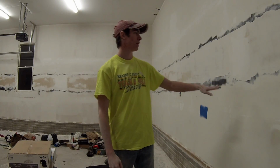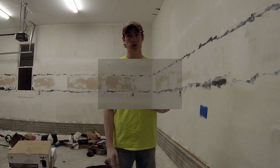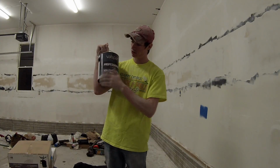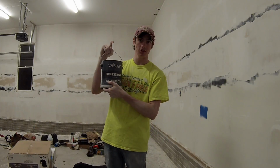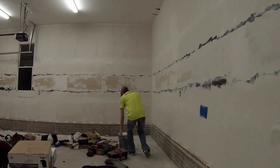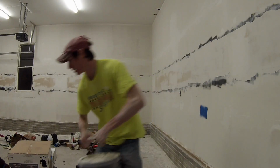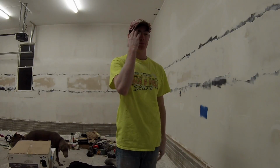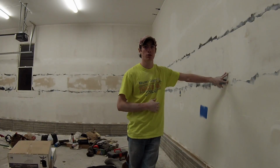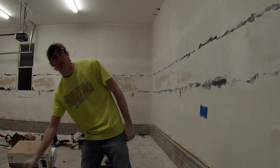Anyway, after you joint compound, you basically have to sand, and then yeah, I'll show you this real quick. So basically, instead of using an actual drywall primer, which is what this is, new construction primer that goes on drywall, I just used this stuff right here. This just $30 special from Walmart, like I stated in another video. And what they said is that caused a problem with moisture and stuff, and that it didn't seal the drywall. And so that's where I got that bubbling from. So basically, I'm starting from scratch all over again.